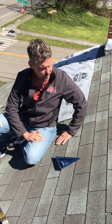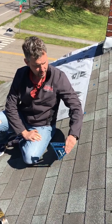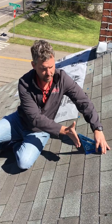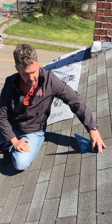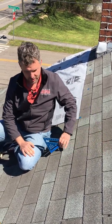What I'm gonna go ahead and do is perform D3161. Pretty simple test. We're gonna loosen the shingle, use the speed square, and move the shingle to 90 degrees. Then check the shingle after we lift it to 90 degrees to see if there's any brittleness or fracture within the mat or loss of granules.